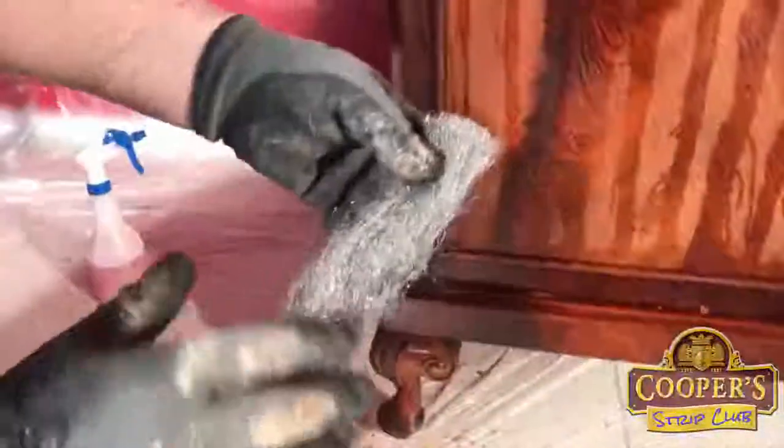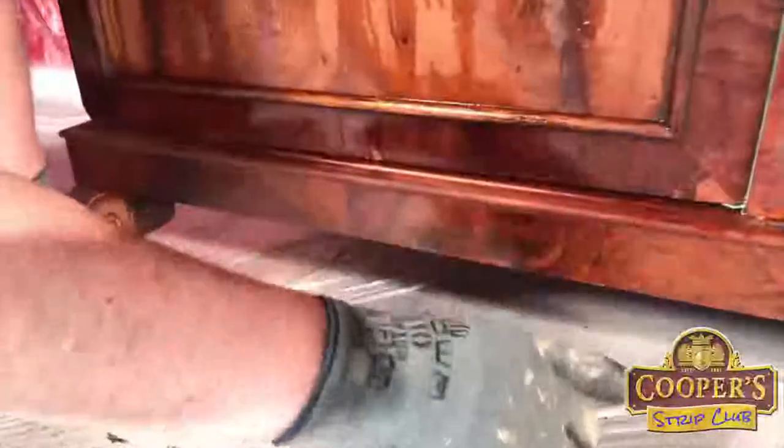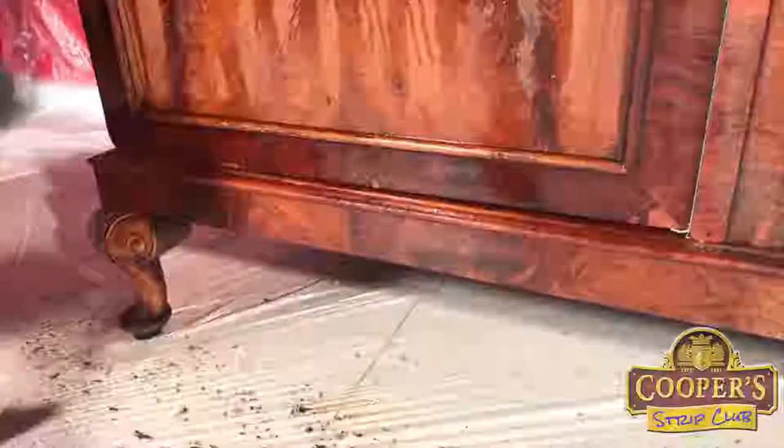So this leaves the patina in place. That's where the steel wool comes in, I haven't talked about this yet. This is our European made steel wool. It's very long stranded and it's sharp and it's ideal for these types of places. And we never scrub the surface if it's gone dry, you must always put a puff of stripper on so that it has a chance to work, so it's way better. But we wouldn't go across like that. Well, I'm a bit nervous with the grain going up and down there. So again, what I'll do is use the roughness of the old gnarly towel.